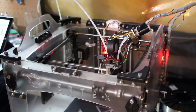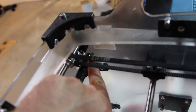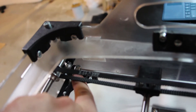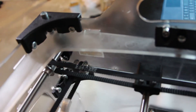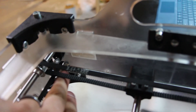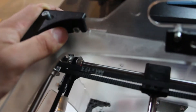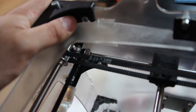I think I see what's going on here. This gear wheel right here — a screw has worked its way out of it. So the alignment is now fine, but the problem is without the screw to hold it in place, this gear wheel is just moving totally freely on the rod, which means it's not contributing any strength — it's not actually pulling the belt, it's just sitting there. Fortunately I managed to find one of the teeny tiny little screws. I'm going to try and sink it in there and hopefully that solves my problem.